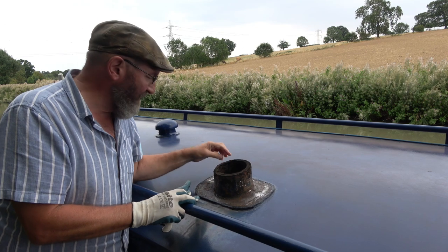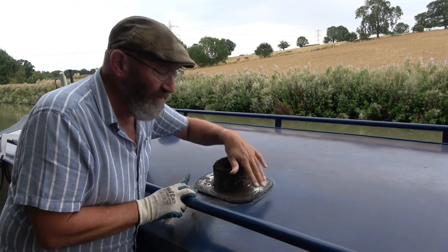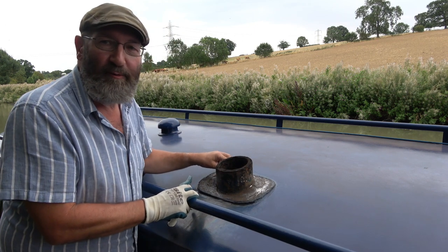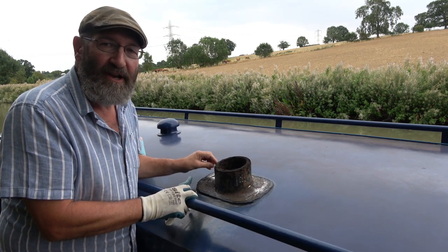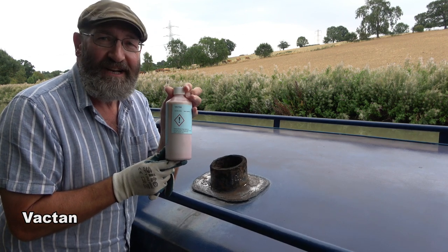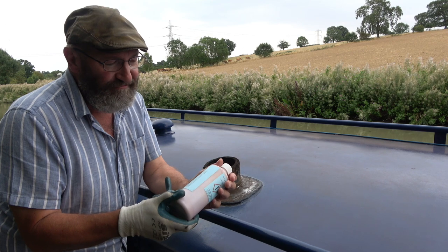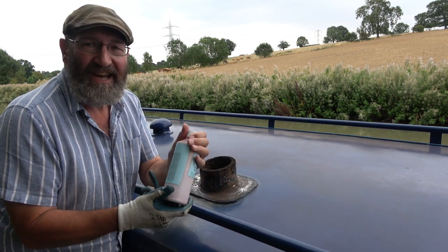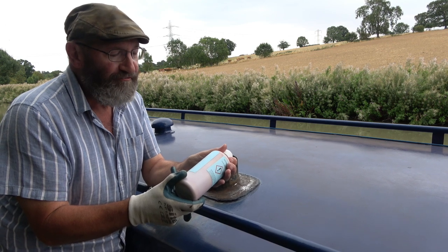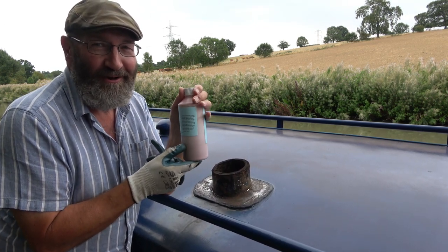I'm very pleased with the way this has dried — it's quite firm now and looks like quite a good finish. It doesn't look pretty but I think it's a good finish from the point of view of being weatherproof — I can always go over it again. I'm going to treat the metal with Vactan. I bought this some while ago so I hope it's still okay. I've given it a good shake — the only requirement is that it shouldn't be less than five degrees, so the temperature is okay. It says apply by spray or brush, 40 micron thickness coat is optimum — I don't know how to work out the micron coat so I'm just going to crack on and do it.